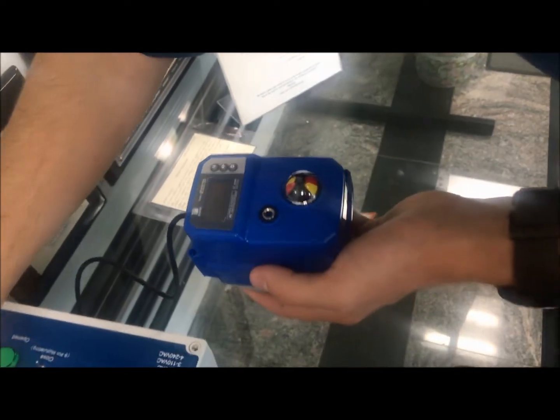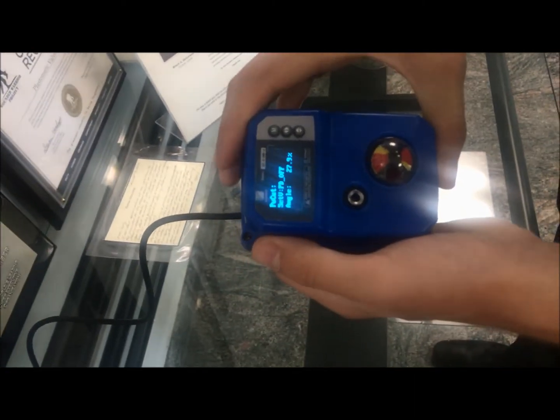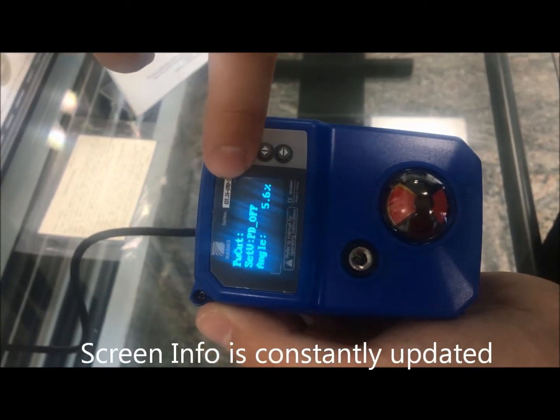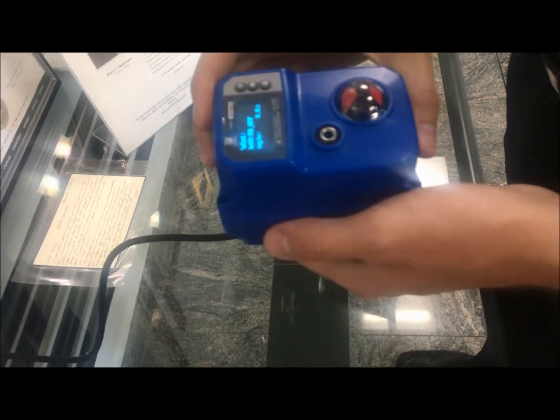There's a lot of control available on this actuator, which is really cool. As you can see, the actuator is now powered off — you can see 'power cut' on the screen, and PD is set to off so it's going closed. The angle shown confirms the actuator is fully closed while power has been shut off.